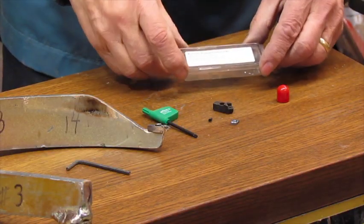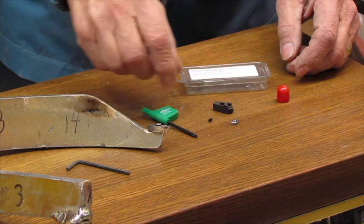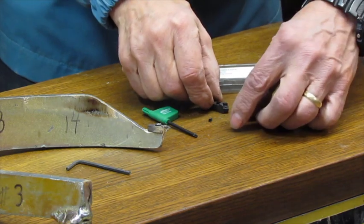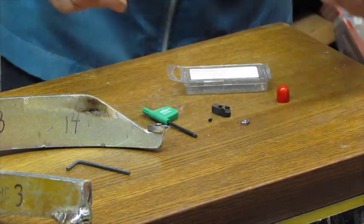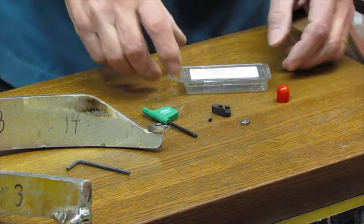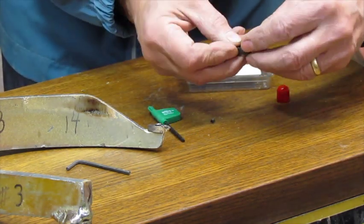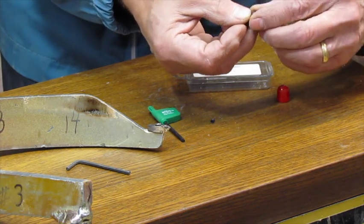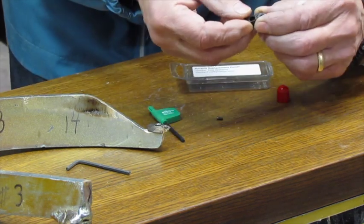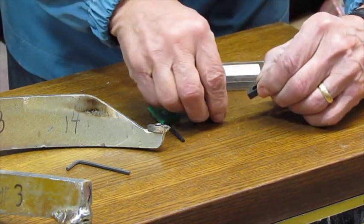When you get the Korpro, I'll just show you how to replace your existing cutter with the Korpro. The Korpro comes with the cutter already attached, but eventually you'll want to change the cutter and put a fresh cutter on there. So I'll put the cutter on here right now, and then we'll put it on the number three jaws, or number three set. So let's go ahead and put this on. I'm placing that in. We have kind of a diamond shape here, and it just slides right in.